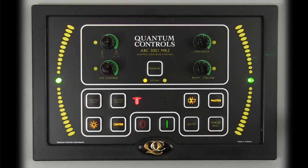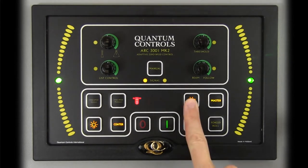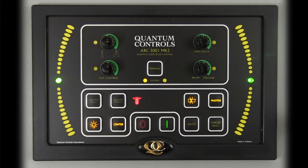When one of these three alarms is triggered, a buzzer will be audible. To silence the alarm buzzer, press the alarm silence button. To clear the alarm, the alarm condition must be corrected. Some vessels choose to have these alarms displayed at a central alarm monitoring system instead of, or in addition to, display on the ARC control. Silencing an alarm at the ARC has no effect on alarm indication at the vessel's monitoring system.